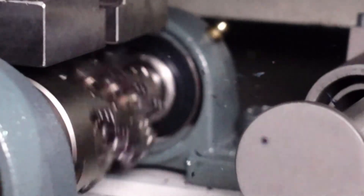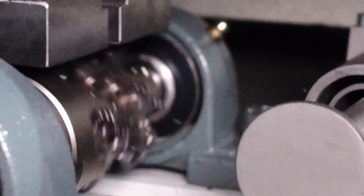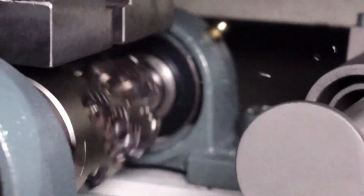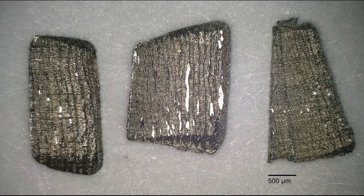The special geometry of the cylindrical cutter results in a rapid shear strength reduction within the material and an early detachment of the chip from the sample surface. Accordingly, the produced chips are short and flat and have a smooth shape without ribbons and threads.